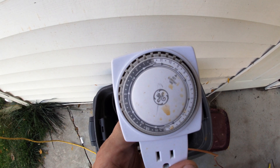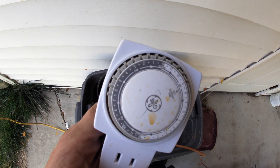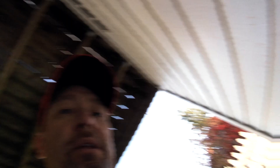This worked remarkably well. If you've got an extra pump laying around, that part would be free. The hose and fittings are pretty cheap, plus a little bit of electricity and the power of the sun. Here's the timer I used — I set the current time and have it going 15 minutes on, 30 minutes off, from about 8:30 in the morning to about 7:30 at night. Worked remarkably well. I hope this helps other people — when I was searching for solar heater ideas there wasn't much out there. If you have any questions feel free to comment and I'll try to help. Thanks!